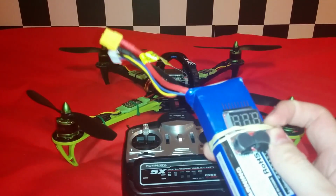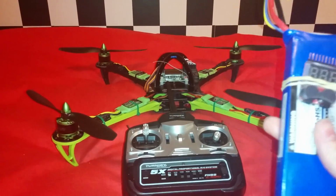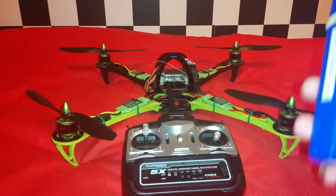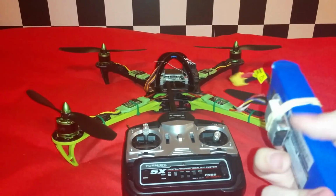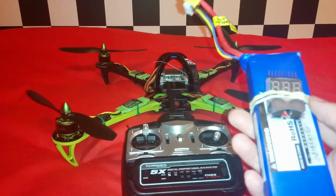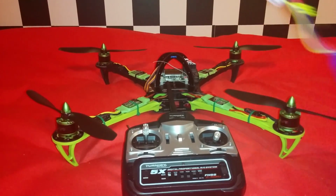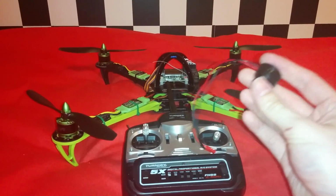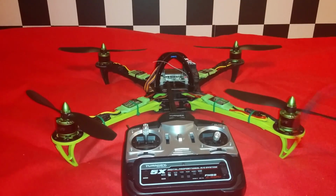I did do another video on my channel showing how to hook up the voltage checker on the KK2 board, but it's not very good. It's not accurate at all. I found that a fully charged battery here, which on a 3-cell should come to 12.6 volts, was showing 13 volts on there. So you can attach a voltage buzzer and a voltage light straight to the KK2 board, but I wouldn't recommend it.